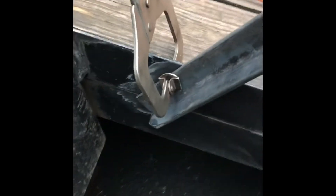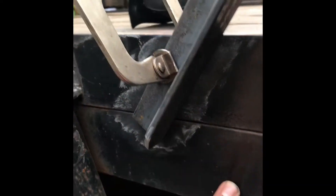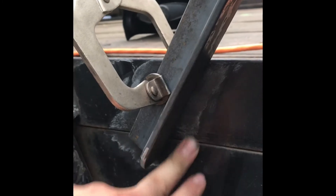Cut this edge off because it's going to be pulling in the four-wheeler, so you don't want to get a flat. Got that angle iron back together because I cut the weld. This is the brace that's going in — I wanted to make sure it was crossing over the channel frame and the top frame and joining them together. Then I'm gonna run a stitch weld here and here, because you can see where it kind of wants to separate right here even though it's welded underneath. It'll be all solid when it's done.